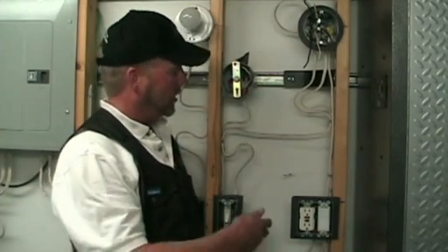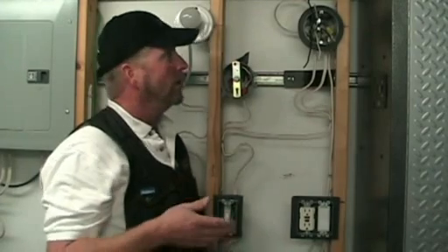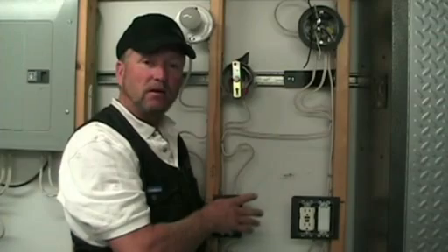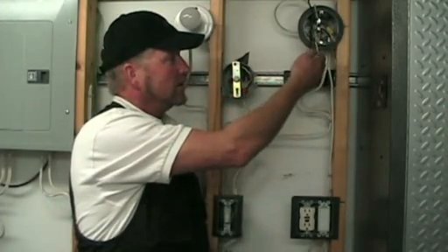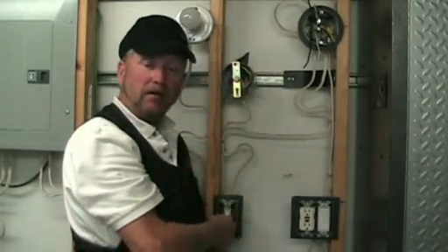What we've got in a case like this is three sets of black and white wires. Since there are no three-wire cables in this situation, I know that this circuit is likely wired with only one switch — no three-ways involved. This is likely power in. One of these cables will be your supply, one will be your power out to the rest of the circuit, and one is going to be a switch-leg drop down to the switch. Typical wiring situation.